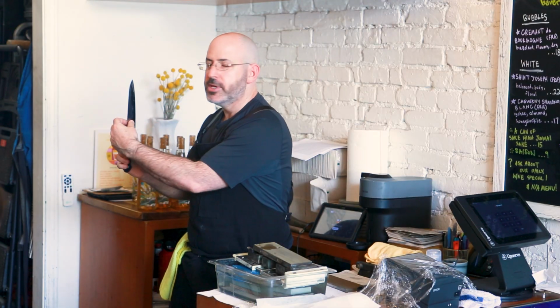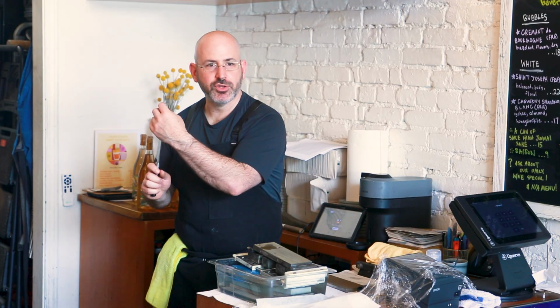I'm going to make a burr through the course of the sharpening here, so you guys will all have a chance to feel what that's like, and so everyone knows for sure, yes, I have a burr. If you're not sure, like if you're sitting and you're like, I don't know, do more. Just keep sharpening until you're 100% sure that you have a burr. As you get better at sharpening, you'll be able to form smaller burrs and waste less metal, but it's more important that you get good results than it is that you're wasting the absolute minimum amount of metal in the beginning of sharpening. So again, I can place my thumb here and feel on this side, or alternatively, I can place my thumb on this side and feel on this side. And I'm going to do that all the time.